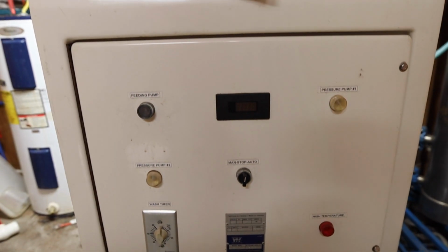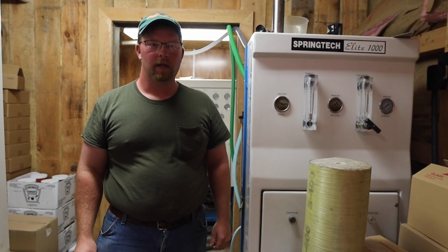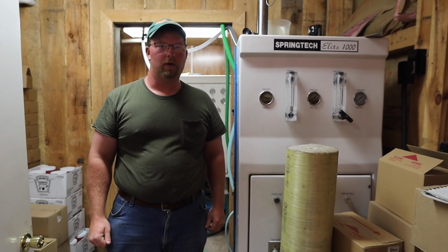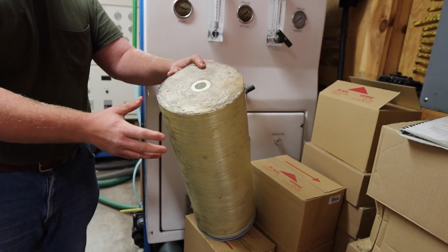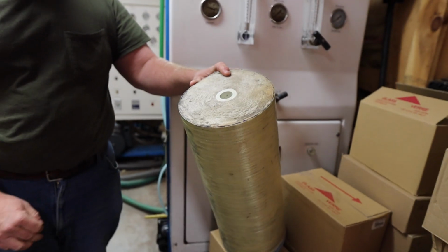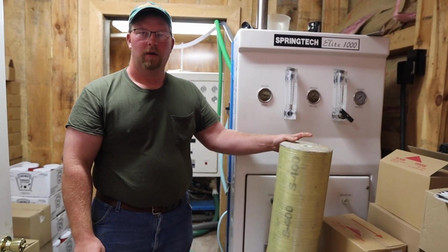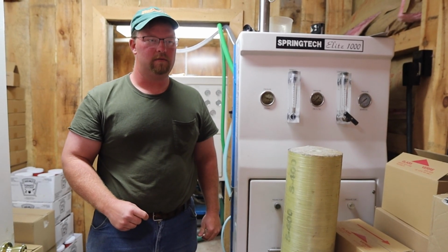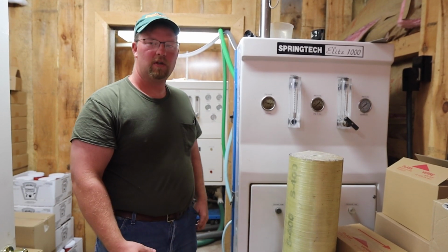These are our reverse osmosis machines. After the sap gets hauled in, it gets dumped into a tank out back. It feeds through the reverse osmosis, which separates the sugar from the water. The sap passes through a membrane. This is a cutout of a membrane under pressure, approximately 400 psi. The water can pass through the membrane, but the sugar can't. We can adjust the flow off the center of the membrane to the desired sugar content that we are looking for. We run through two reverse osmosis machines.